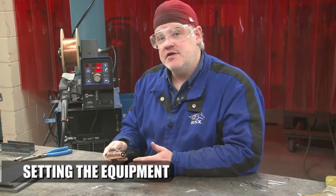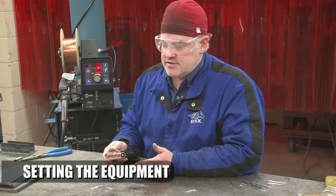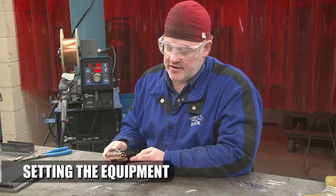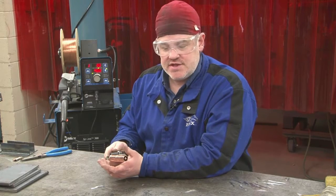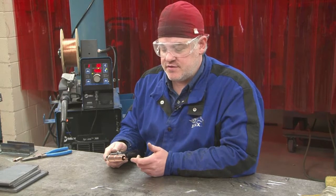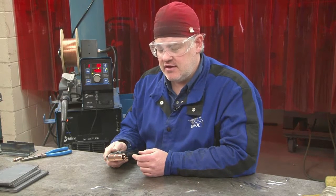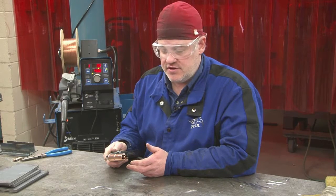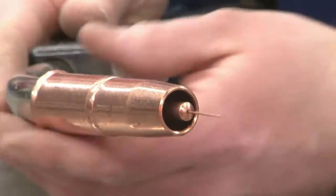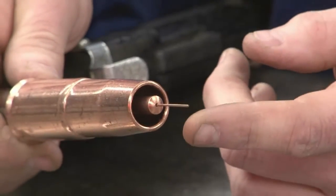We want to take into consideration our contact tube setback, especially with pulse spray transfer, because of the volume of heat of the arc. Right now our contact tube setback is flush — the contact tube is flush with the nozzle, so setback is basically at zero. Because this is a two-piece nozzle-insulator system, I can pull the nozzle back to expose the contact tip. For short-circuit transfer, contact tube setback is really not a factor because we're welding with lower heats. However, with pulse spray transfer, your contact tip will take so much heat from the arc it could melt. So we want about one-eighth of an inch of contact tube setback below flush.